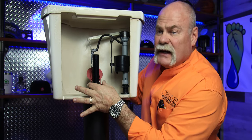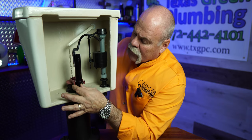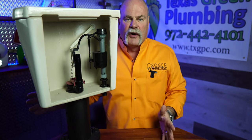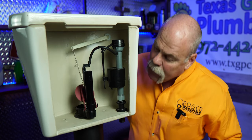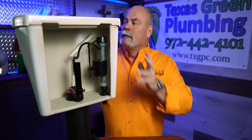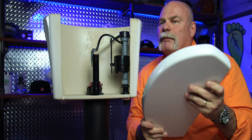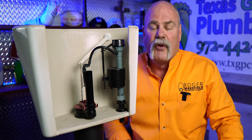You can see where the flapper is attached — this is where it pivots and goes up and down. To remove the flapper, the very first thing you're going to do is turn off the water. Reach down under there and turn off your angle stop. The next thing is to flush the toilet to get as much water out of the tank as possible so you're working in a dry environment. Then go ahead and take the lid off — be very careful because I've seen many plumbers drop and break a lid.